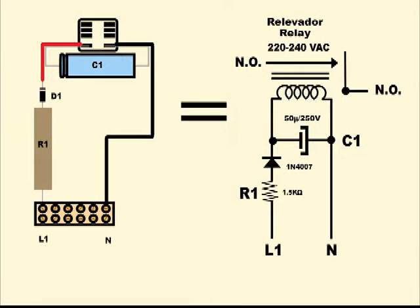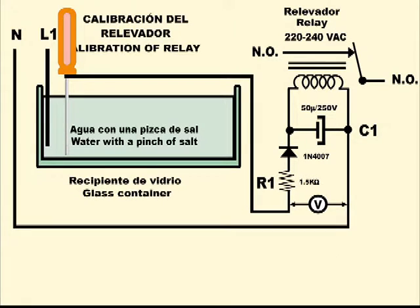The construction of the circuit starts by building one of the three units and calibrating it in a very simple way. For this purpose, a voltmeter is connected across the voltage input to the unit between phase and neutral. This voltmeter will indicate the voltage the unit is receiving at a given time. Although resistor R1 is shown as 1500 ohms, this value depends on the sensitivity of the coil of the relay being used. It is best to make sure by fitting the unit through a variable resistor — in this case, the salt water container — and perform several tests with various values for the resistance of R1.